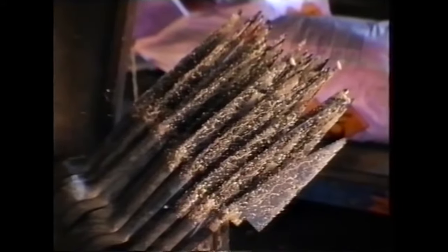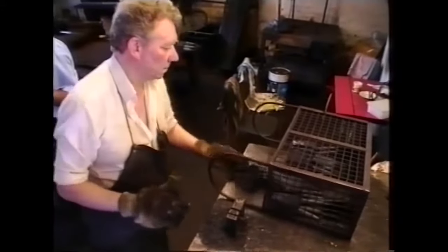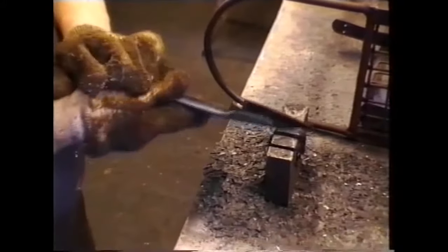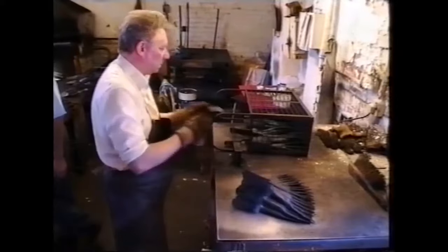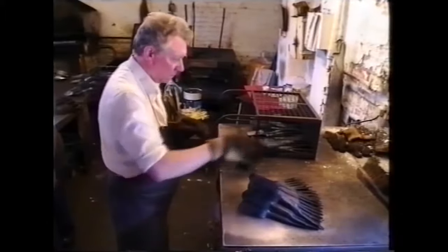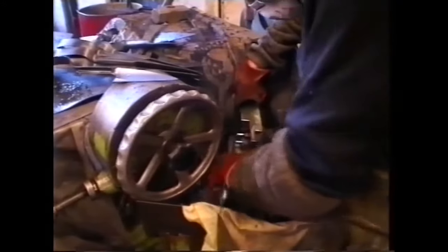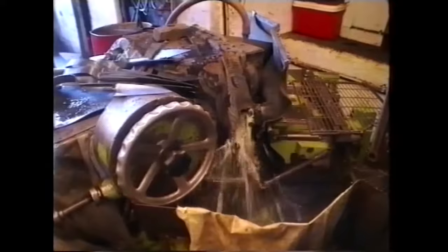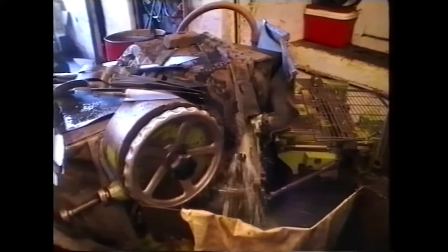There we see some salts remaining that have got to be washed off. The final job before they go to the machines is that the blades have to be straightened. This machine is a hollow grinding machine, and it grinds the inside blades which have been hollow formed previously. Normally, one man works two machines in tandem.